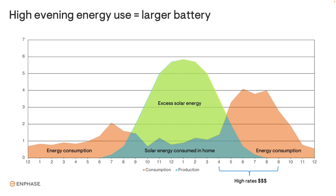The amount of excess solar energy is mainly influenced by two factors. The first factor is the size of the PV system, which should be sized to produce the same amount of energy annually that the home consumes. The second factor is the consumption profile of the customer — at what time of day do they use more energy, and at what time do they use less? In this example, the customer has a typical energy consumption profile with lower energy use during the day and higher energy use in the evening. This system has a lot of excess solar energy because energy use in the home is low during the day.